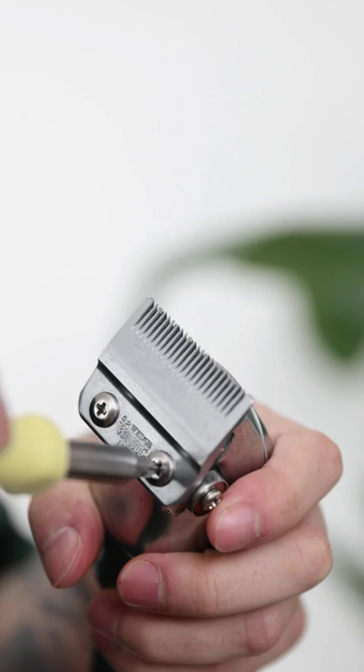Then just do the one-eyed thing till you get as close as possible to the edge, just right under it. Then tighten up the screws one at a time, back and forth, so it will tighten evenly. If you just tighten one all the way, sometimes it will move the blades out of line and you'll have to start over.